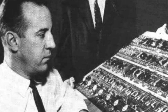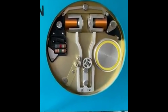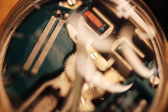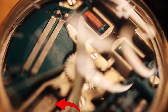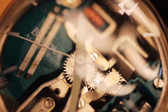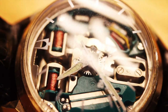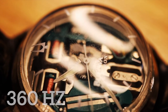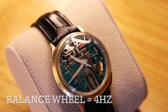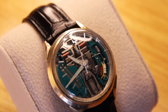Engineer Max Hetzel developed the transistor movement, which was able to achieve an unprecedented precision of one minute per month. You have freely vibrating elements at the tip of each tine of the tuning fork, which interacts with the drive coils at the top of the movement. The drive coils generate a pulsating magnetic field which keeps the tuning fork humming. The cell coil assembly transfers energy from the battery to the transistor circuit that controls the tuning fork frequency, located at the nine o'clock position. This micro tuning fork oscillates at 360 hertz — a much higher frequency than a classical balance wheel — giving this watch 99.9977% accuracy and a unique humming sound.